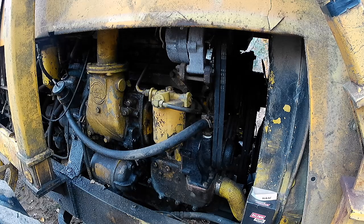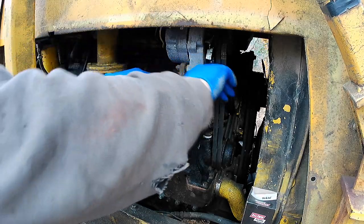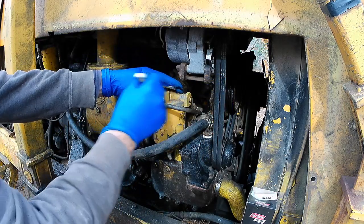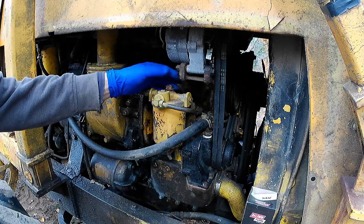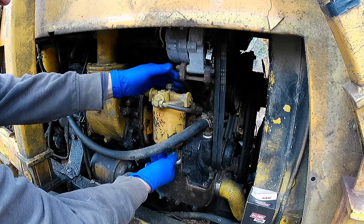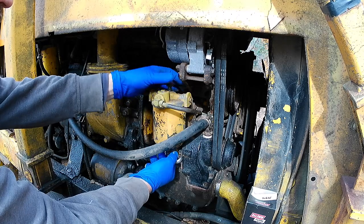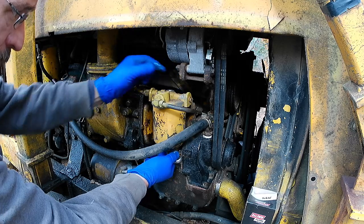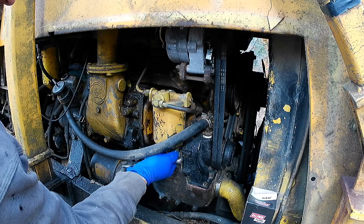And so basically this is just a 3/4 inch wrench, and this is a cartridge type, not a spin on, a cartridge type. Not the same thing, two different things. And I don't always change the seal on the bolt every time, but today we will, because it's looking a little ratty. And of course that all comes in the kit. I'll show you here in a second. It's staying up there pretty good, so we got a good seal there somewhere.